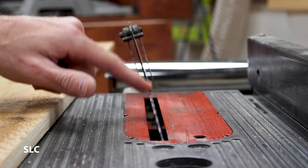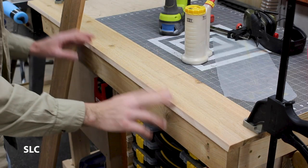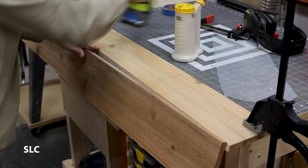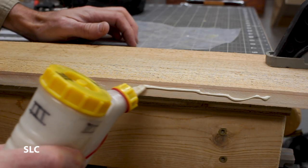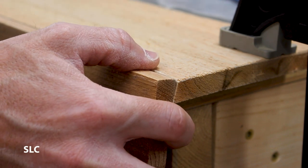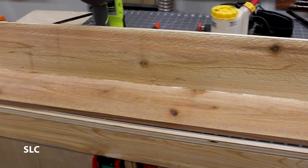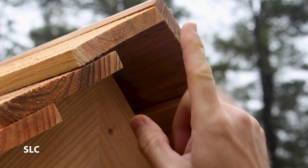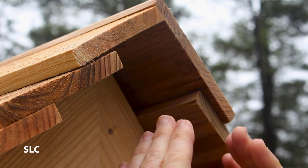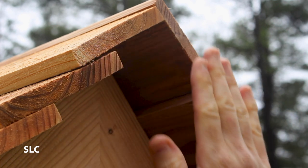After a few measurements we're going to rip this one board down to about 15 degrees. I've clamped this to my bench for a little more control — I'm going to put some glue along this edge and carefully position the board and add some brad nails to hold it in place. Just a reminder, this is type 3 glue so it should work great outdoors. I just took it outside for a quick test fit — this is flush, this is flush, and this is about a half inch off. I realized when I was putting these roofs together I forgot to check and make sure everything was square, so they're slightly off. I think I can trim this down a little bit at a very slight angle and make it still work.